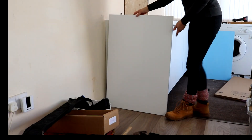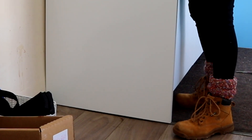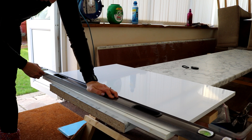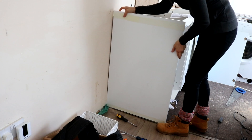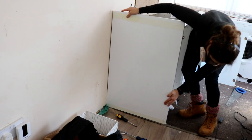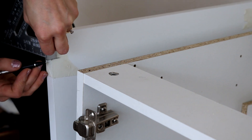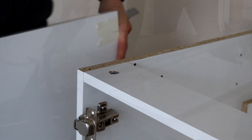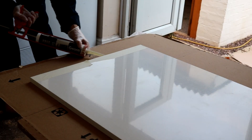Then on to the end panel I completely messed up. The problem was the floor wasn't level — probably partly due to the carpet trim — and I tried to cut from the back instead of the bottom to avoid future water damage, but I'm not the best at scribing. I made one wrong measurement and had to make the end panel too shy. When I told my dad he said it didn't really matter because it's white, so I carried on fitting it. However, a few weeks later, off camera, I still wasn't happy, so I completely redid it, tracing around the panel to do it properly. The fitting process is exactly the same though, so I'm still showing this bit — just imagine it's a little bit deeper.